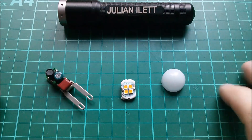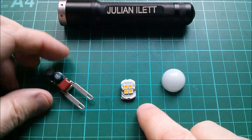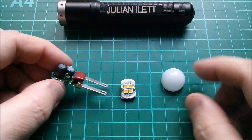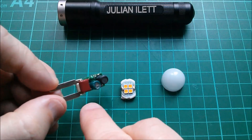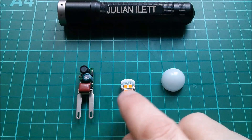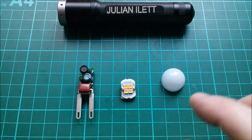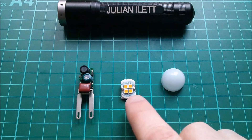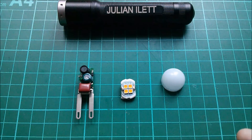Good morning all. Just a quickie - this LED, or block of four LEDs, or at least what looks like a block of four LEDs, was in this light bulb. It's a G9 LED replacement for an incandescent light bulb. This is the circuit. I said at the time that I thought it was a capacitive dropper. I'm now not entirely sure that's the case because there was mains on the input connections here, and I measured a DC voltage across the LED plate of 80-something volts, so it isn't actually dropping much. I'm just intrigued by whether this LED block - what appears to be four LEDs - actually takes 85 or whatever volts before it lights up. So I want to just do a quick test.